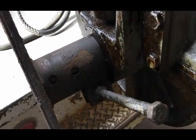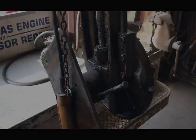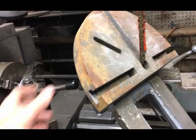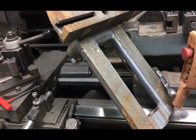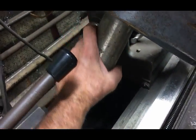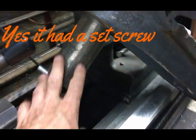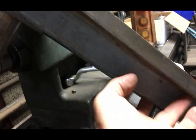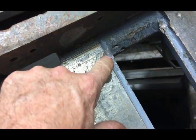I've already got a new base machined and welded up - that'll be a standalone video just for restoring the vise. Basically why I'm having to make the booster chair riser blocks is the main shaft that supports this whole vise is stuck in there pretty good. I'm not sure if it was cast right in or not, but I put pretty good force on it, and rather than taking a chance of cracking anything, I decided to make something where I can put it in the mill. I needed to support those two rails underneath and needed about eight and a half inches of height.